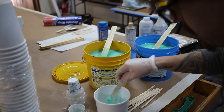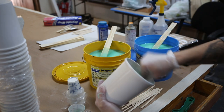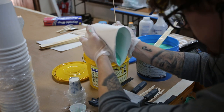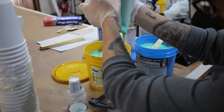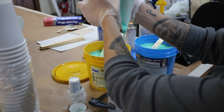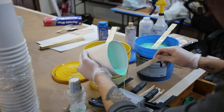We have about 7 to 8 minutes working time. I've never worked with this fast a silicone before, but I like the idea of things moving fast, because when you're doing a brush-up of silicone, nothing's worse than chasing it for an hour while it's drippy and dripping all the time. So that's our final color — both A and B tinted. We're doing these tiny parts to establish the final color of the skin, because you don't want to start brushing up on the face and have the skin look weird with miscolored areas. It's much easier to just scrap a small test and try again.